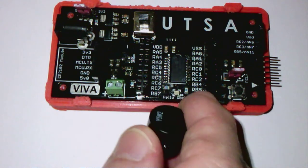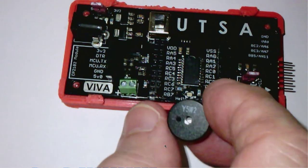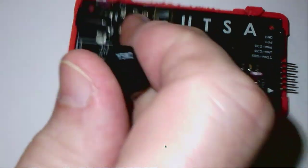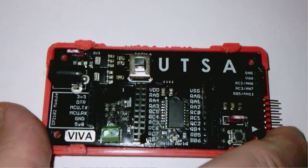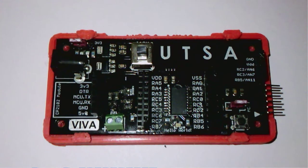You change the timing factor in the loop and you'll have a different tone. You could set that up in a number of different ways. You could even drive the input to this switch with your arbitrary waveform generator — that module on the chip — and that would work fine.